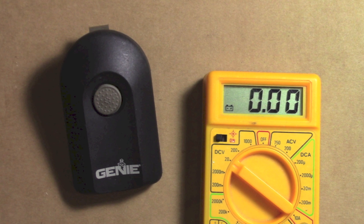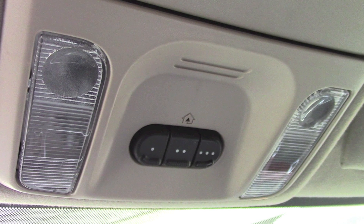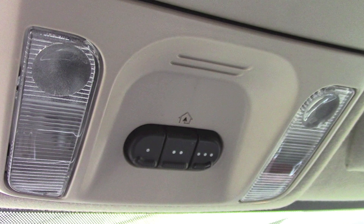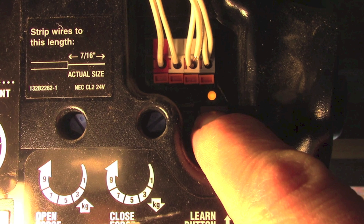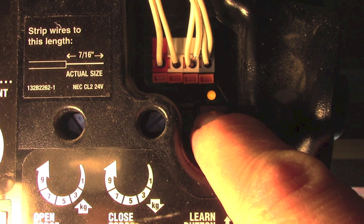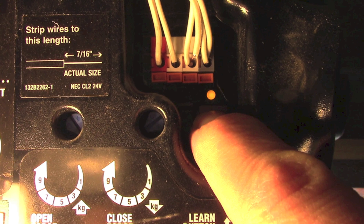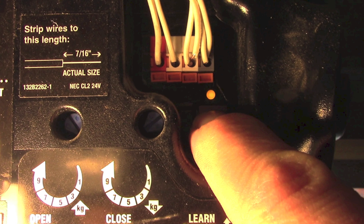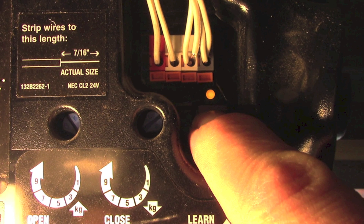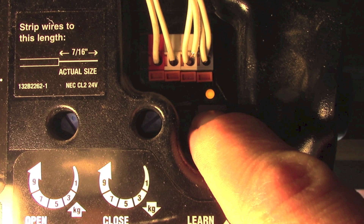There are a lot of little problems that can go wrong with these, and there are forums dedicated to answering these questions. If none of that works, try going to the garage door opener itself and resetting the entire thing. Garage door openers can learn several codes and there may be a computer glitch. Find the learn button — on Genies it might be a little black button; on LiftMasters I think it's purple. Open it up and hold it down — you'll need to hold it for at least ten seconds. You'll see a little flash letting you know all codes are reset, and then you'll have to program them all over again. Give that a try — resetting that as well.